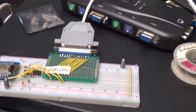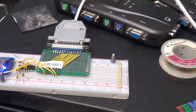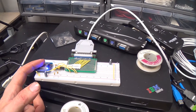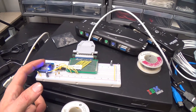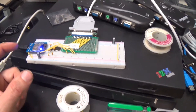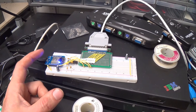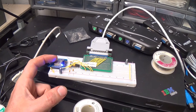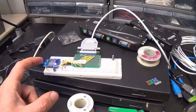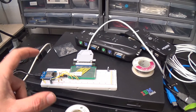The reason this is maybe not quite as un-noteworthy as it would be otherwise is that in the previous video I was talking about how I didn't think I could use FreeRTOS and the Arduino IDE at the same time on this thing. The manufacturer's SDK documentation is confusing to me. But I programmed this with Arduino, and it's not running FreeRTOS — I rigged it up so that the LED flashing is actually running off of a hardware interrupt service routine on a timer. That'll allow us to keep processing serial and Wi-Fi data while a DCL interpreter on this thing is blocking for input.